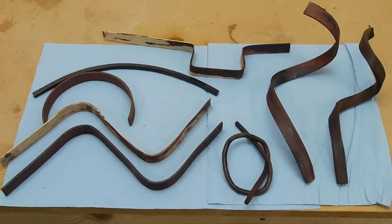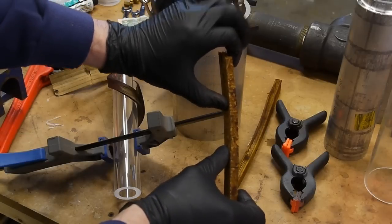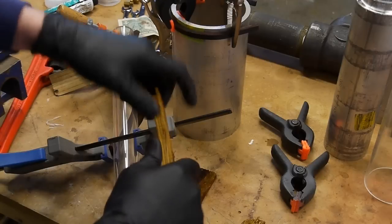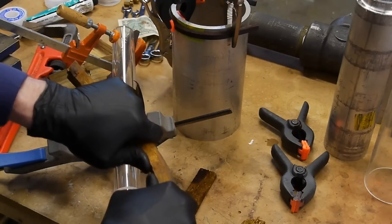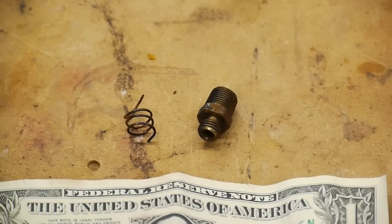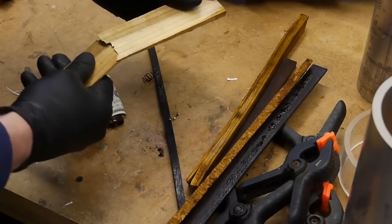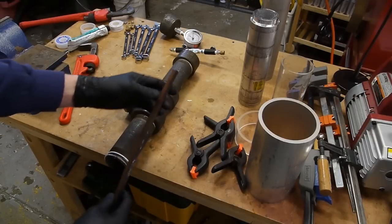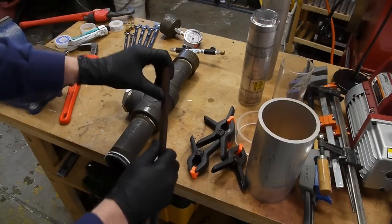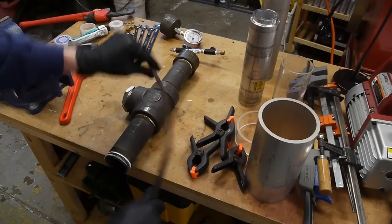I removed the wood samples and found that the particle board and plywood didn't work at all. The plywood might have been interesting because the layers could slide past each other, but it doesn't do that — it just falls apart. The copper wire and brass fitting were definitely corroded but didn't turn to powder. Surprisingly, the softwood, which was some kind of pine, didn't really soften well either — it just snapped. However, the hardwood samples all did pretty well; some of them were quite flexible indeed.